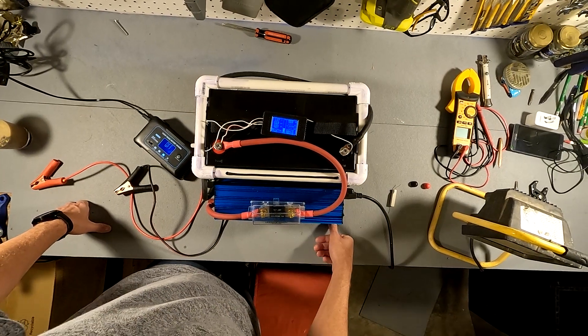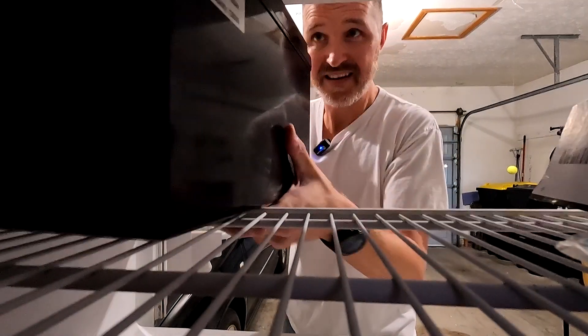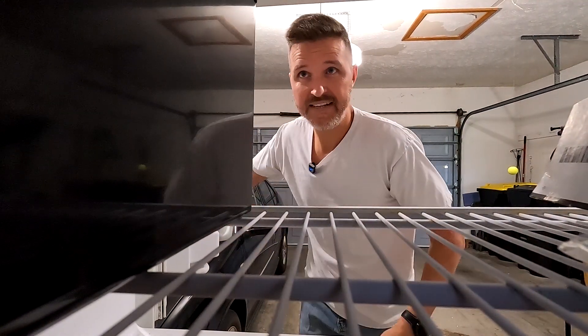Now that this Uniwigs battery has passed our capacity test, I'm going to test if it has cold temperature disconnect — whether it will even charge in zero degree weather. I didn't get any information in the packaging; it didn't come with any documentation. So the only thing I can go on is what it says on their Amazon site. I'm going to throw this thing in the freezer, leave it there until tomorrow, and then we'll try to charge it and see what happens. See you in 18 hours!